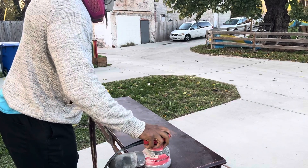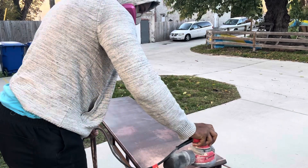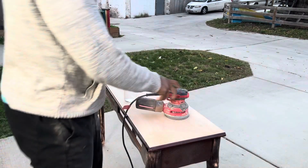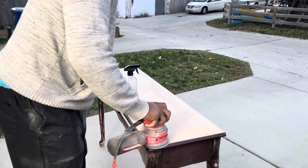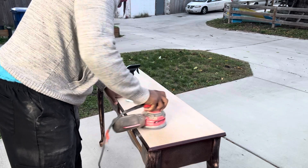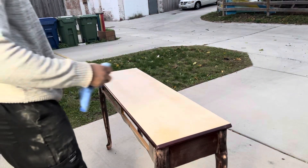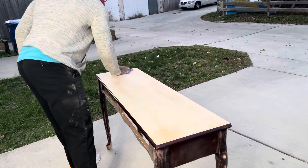My original plan was to take the top of the table back down to bare wood. Going through the process, I realized that this wasn't a solid wood table — it was like a particle board or something — and I began to cause a little patch or hole at the top of the table from too much downward pressure. Also, I should have been sanding from left to right; if this was a solid piece of wood I should have been going with the grain. In this video I was going against it, which is an error — you don't want to go against the grain.